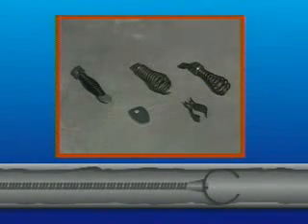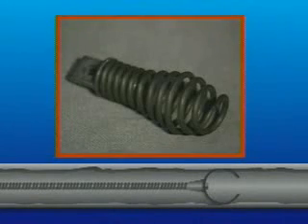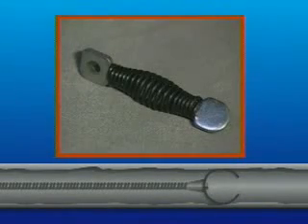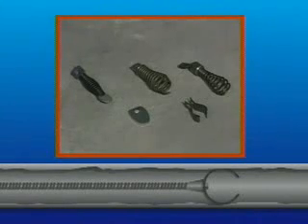Know how to shut off the machine in an emergency. Choosing the right cables and cutters for your clogged drain problem is important. Your dealer will supply the appropriate tools for your needs. The cable may have a spring on the end, or it may have a connector for attaching cutters. The boring gimlet and arrowhead are good cutters to start with. The down head boring gimlet and flexible arrowhead enable the cable to go through tight bends and smaller lines. The inch and a quarter side cutter blade is a good finishing tool — it's used to scrape the walls of the pipe for a more thorough cleaning job. Start with the smaller cutters, then change to the larger cutters after you've gotten the water flowing.